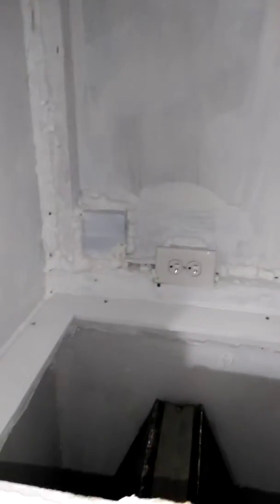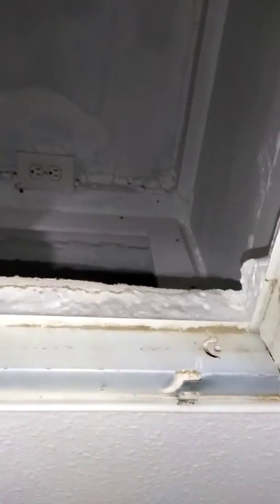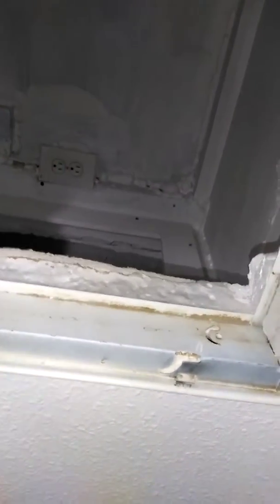And then I'm going to do an electrostatic filter. I'm going to make a box right here. The electrostatic filter will sit at an angle. And then the HEPA filter will be below that. The UV light will be below that. And this filter here is a pre-filter. It's the MERV 11. So I'll have 1, 2, 3 filters on this system with a UV light when I'm all done. And she'll be good to go.